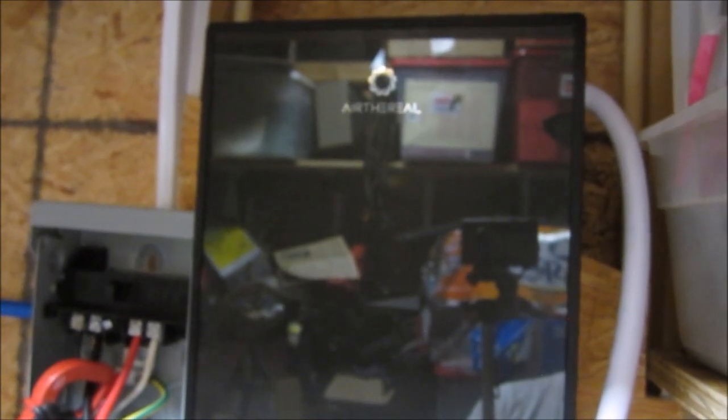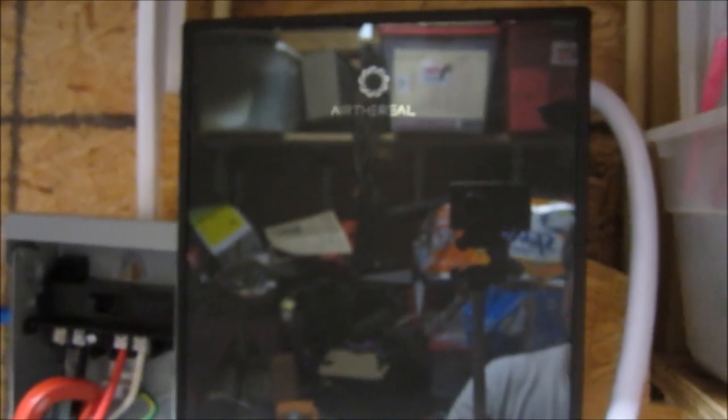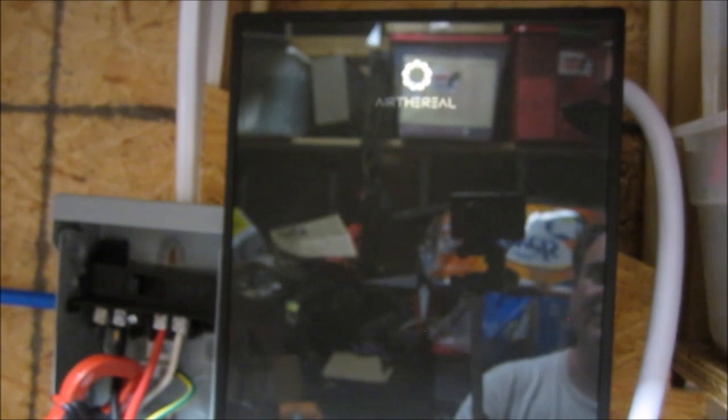These things currently sell for under $180. It's a little more than I'm used to spending on a tankless water heater, especially one that runs under 40 amps. But if it's really going to pull 37.5 amps on your 8 gauge wire 40 amp circuit and provide you with that hot, hot water in the wintertime, then in fact, this will work out just fine